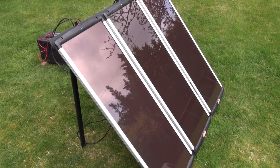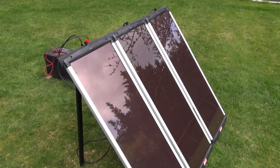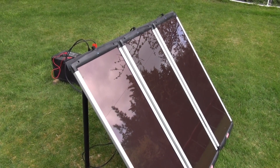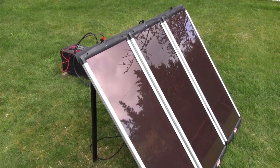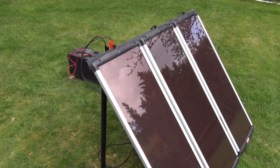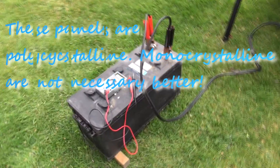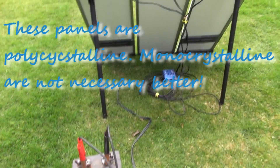I might not always be out with the boat, or I might choose to just use the oars. Give it one day of good charging — anywhere from 4 to 8 hours. I usually get at least 4 hours of good sunlight. If we ballpark 3 amps — not even the max 4 amps — that gives me 12 amp-hours back into my half-discharged, down to 30%, 18 amp-hour Jump and Carry. So you can see how effective it is.